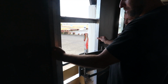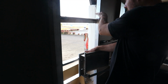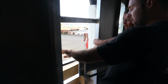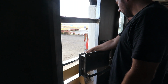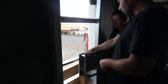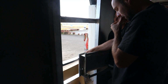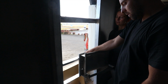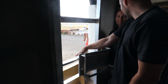See how there's a bow on the door on either side? That's because the dogs aren't right at the top, they're sort of down here. So you're saying that'll pull in? Yeah, it'll pull in like that against the rubber seals. It's still a bit of a gap, eh? Yeah, but it'll seal it up tighter, which is what I want. When you just nip the dogs up, the door will stay shut and won't rattle around. And when you go to sea and you really want to crank it up, you pull the dogs really tight and it'll pull all of that bend in and really compress the rubber. You could probably almost have it underwater and it would probably hold. That's the goal, isn't it? I don't really want to test that, because we've got bigger problems if we're testing that.